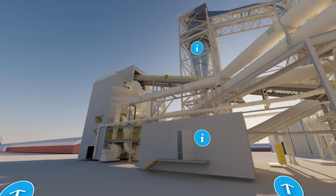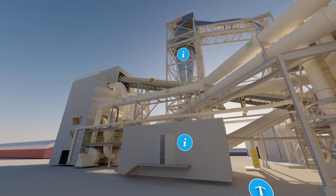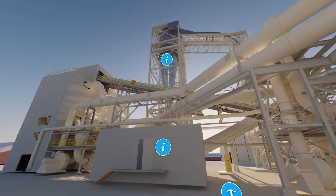The refiners discharge the material into a standard flash tube dryer. The flash tube dryer is something everyone knows from normal MDF processes. It is operated with hot gases at a temperature of roughly 180 degrees, and the total capacity of this dryer is approximately 28 tons per hour.